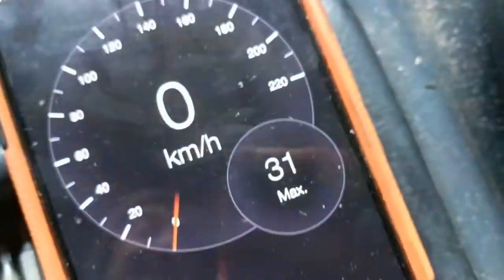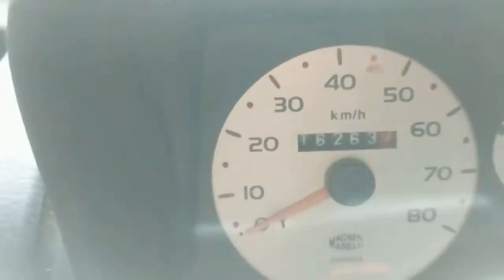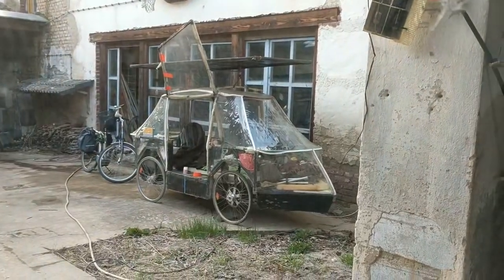This looks like a happy end! Top speed was 31 km/h. You see - this field coil, the stator voltage has to be reduced to increase speed, and therefore maybe the ESC needs to know the speed so it knows when to reduce the stator field. My solar car only drives 6 kilometers per hour, so 45 km/h is already way too fast for me. 31-30 km/h would be okay. Now I can order a license plate and legally drive on the street. Bye bye!